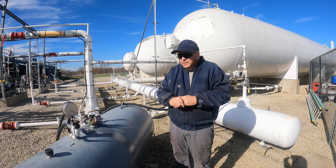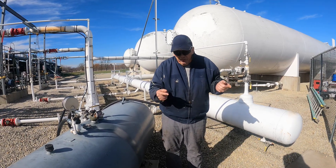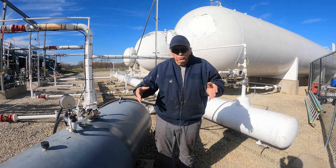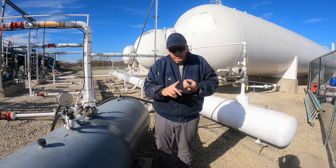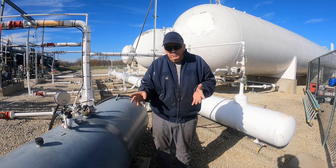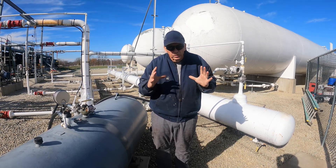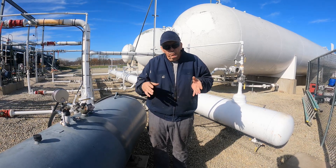I made an earlier video called 'Entrainment.' The key takeaway is that in propane vapor — and this is true for many hydrocarbons or pressurized fluids — there's a fair amount of propane liquid suspended in little droplets. And in propane liquid, there's always some propane vapor trapped inside. Under pressure, vapor bubbles are very small; when there's less pressure, they can grow. That's part of why a vapor eliminator is so important before product goes to your meters.